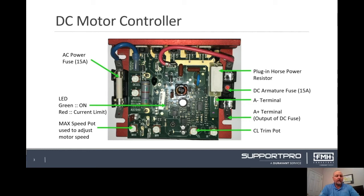On this side, the DC fuse, if blown, could be a stalled motor, a bad motor, or a shorted out motor cable. Check for any damaged wiring and amp draw from the motor.